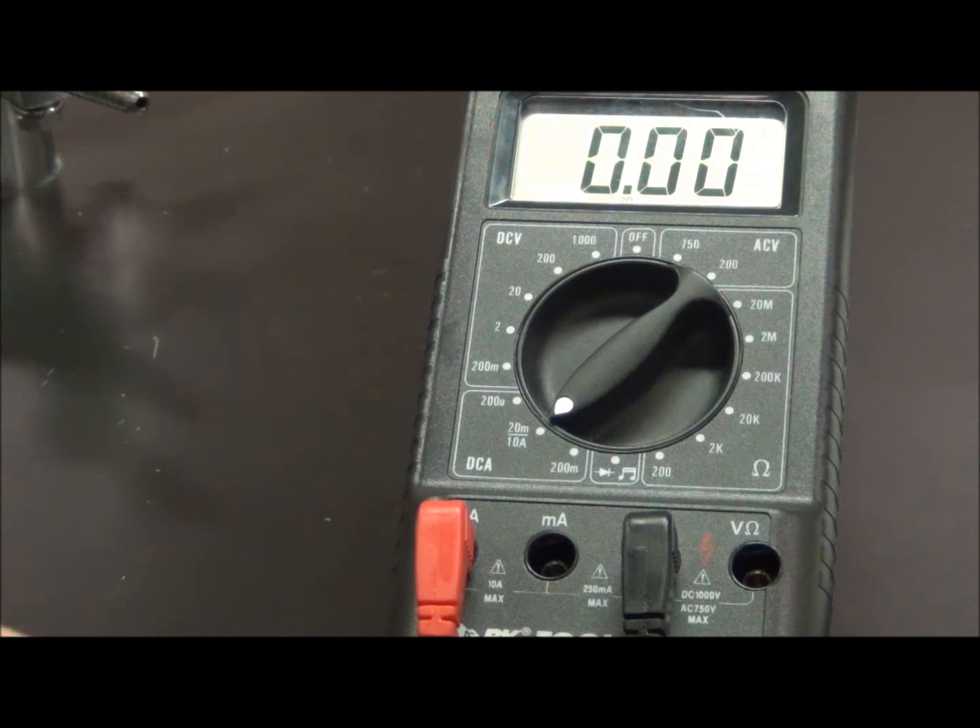Pay attention to the fact that if your amp meter reading isn't positive as you were expecting — if you happen to get a negative reading — all you have to do is reverse the black and red probes and place them on your series circuit in the same location. Just flip the black where the red is and the red where the black is, and that will reverse the sign for you. I'm not going to tell you where I'm placing it on the circuit board right now, because I want you to discover your own readings.